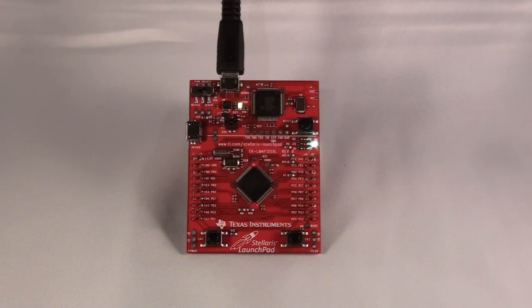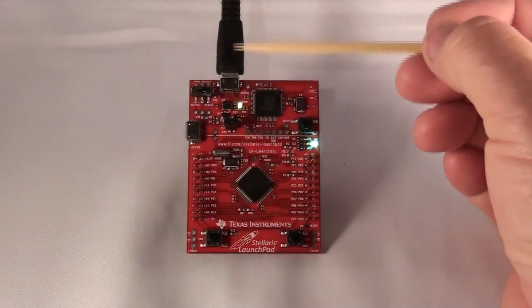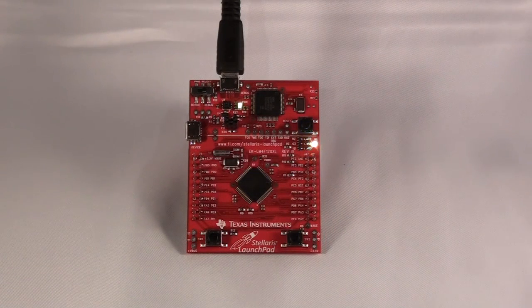In step 29, we can communicate with the board through the UART. The UART is connected as a virtual serial port through the emulator USB connection. The following steps in the lab show you how to run either with XP using HyperTerminal or in Windows 7 or 8 using PuTTY, which you should have already downloaded.